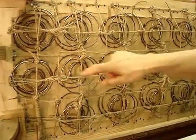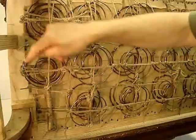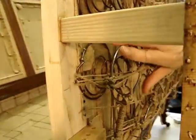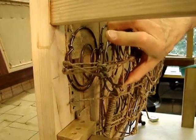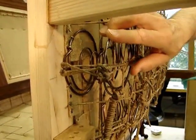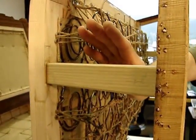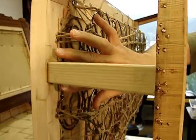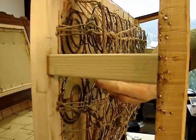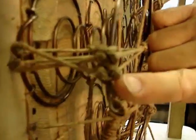Back to the end of the course of springs, it drops down just like we did in the front with a double tie, which establishes the elevation. This is important relative to the inside arm, because the inside arm will roll over the top of the arm structure and tack down to the base of the frame, but will visually terminate along the line of the springs. The springs establish that line as well.